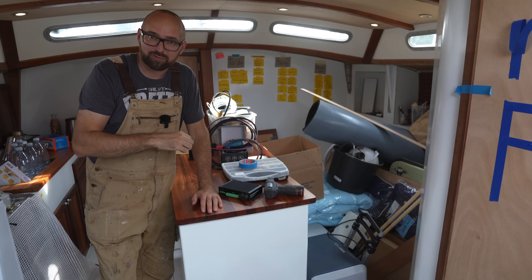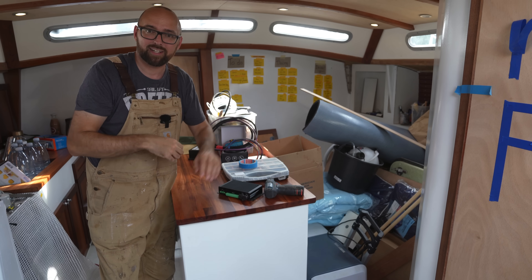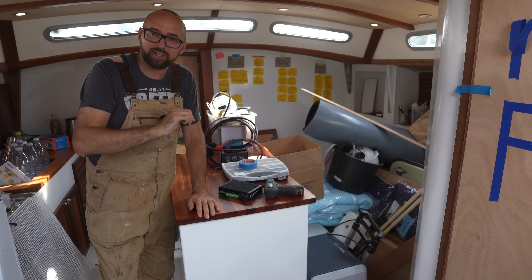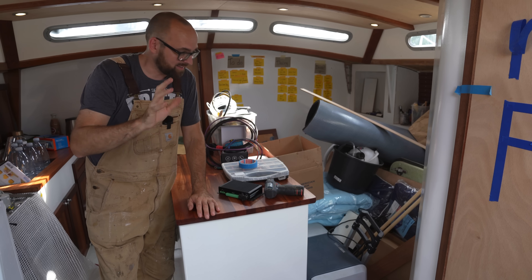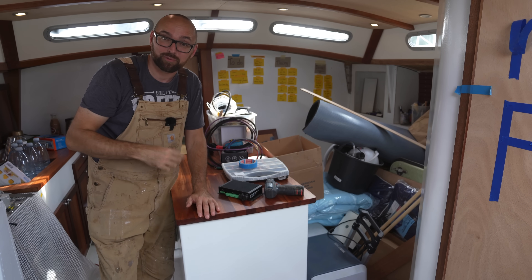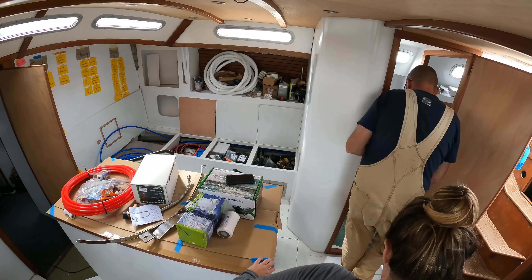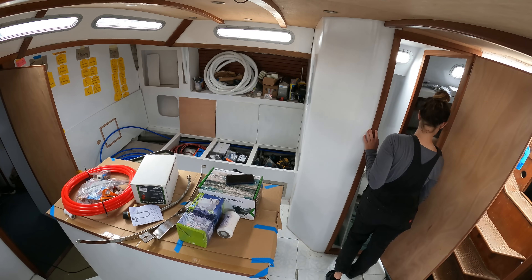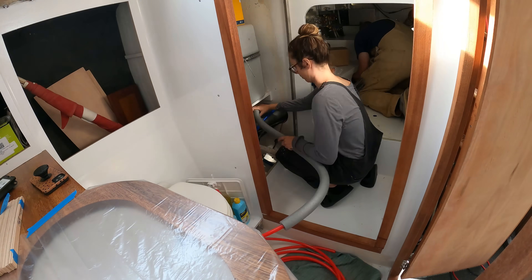Of course we can only use the power assist feature on the Quattro for as long as we've got juice in the batteries — and we've got five kilowatt hours worth of usable energy so hopefully that'll be enough. The Quattro has some other cool features too, like it has two AC inputs — one is going to be shore power, the other is going to be the generator — but that's going to be more for a later video. That should give you guys a quick overview of the electrical systems here aboard Athena. The next day we got started on the pressurized water system. The first step was to run the blue and red tube for the cold and hot water — a somewhat time consuming job but fortunately I still had a little bit of room in the holes I made for running cables when I rebuilt the interior.